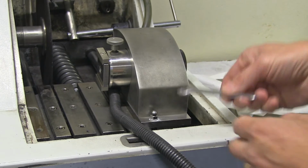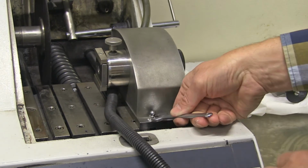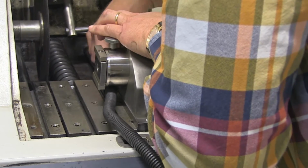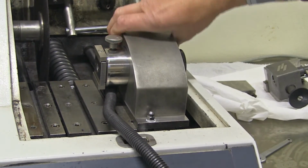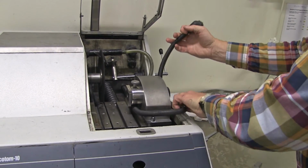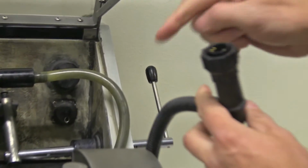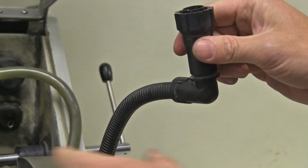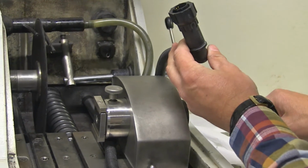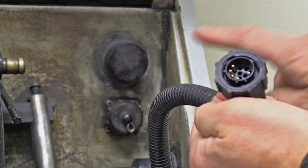Looks like that. Tighten these screws. And there is one back here also. So now it sticks there. The cable comes around like that. And this connector, which is necessary to make this precision vise possible to use with exact digital settings, it needs to go into the connector there. It's much easier to put it in if we remove the cooling water hose for a while. So this connector here should fit into the machine connector there.